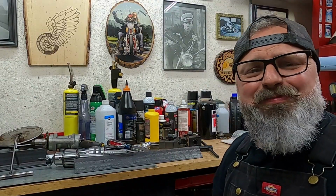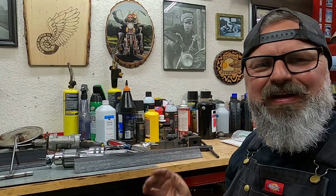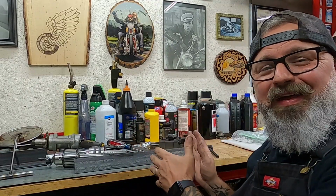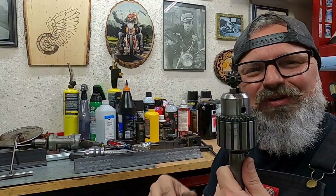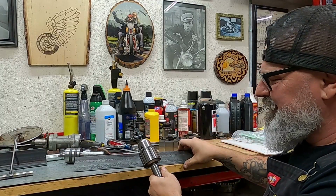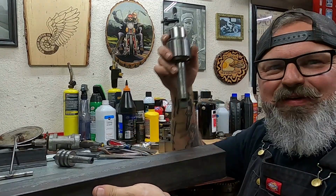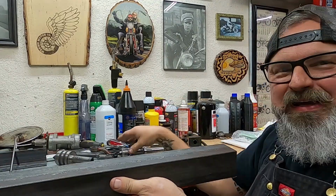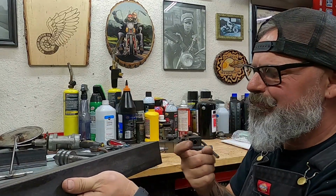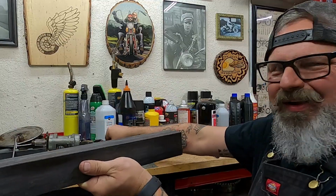That's a lot of stuff to put in a little small area, but here's my idea. As we're working on the lathe, everything down at this end, the tailstock end of the lathe, I want to put all of those pieces and parts, all of those tools that I use at that end of the lathe, at that end of the stand. Things like our drill chuck and our live center. Those things, I'm gonna basically take my angle iron, let me grab my angle iron here, and I'm just gonna drill some holes so that these things can slide down and sit in those holes down at that far end. The other thing right here in the front, what I'll probably do is mount a little tab fixture out there so I can hang my tailstock wrench right on the end. So all of that stuff's down at that side.